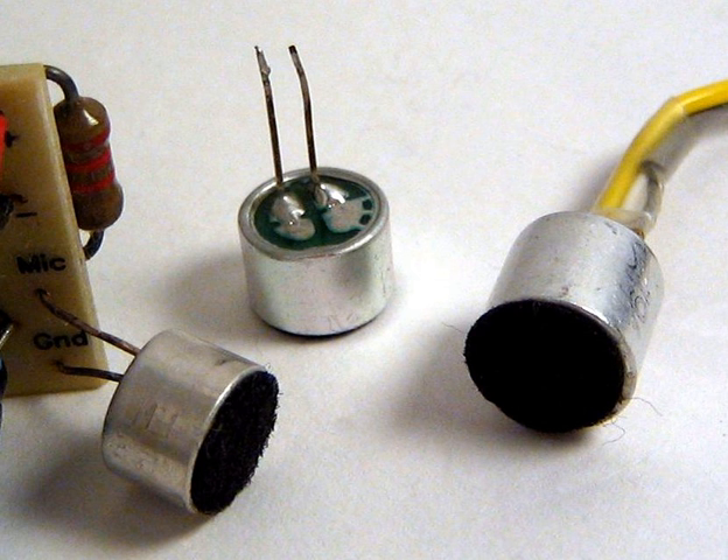It is equivalent to the back electret in that any conductive film may be used for the diaphragm. Unlike other condenser microphones, electret types require no polarizing voltage, but they normally contain an integrated preamplifier, which does require a small amount of power, often incorrectly called polarizing power or bias. This preamp is frequently phantom powered in sound reinforcement and studio applications. Other types simply include a 1.5 volt battery in the microphone housing, which is often left permanently connected as the current drain is usually very small.